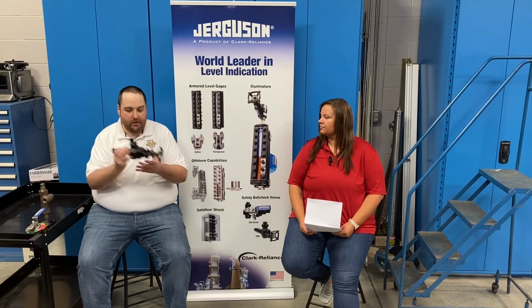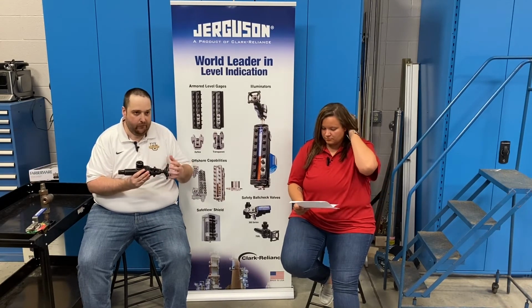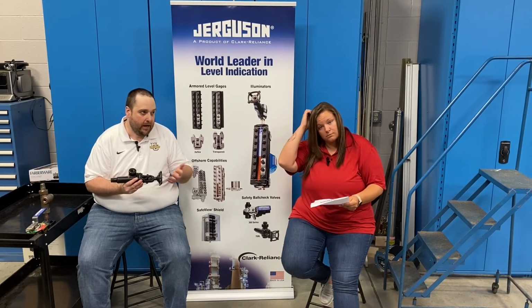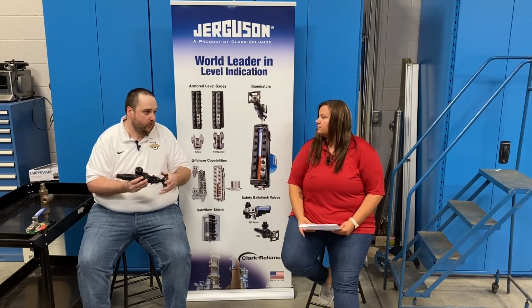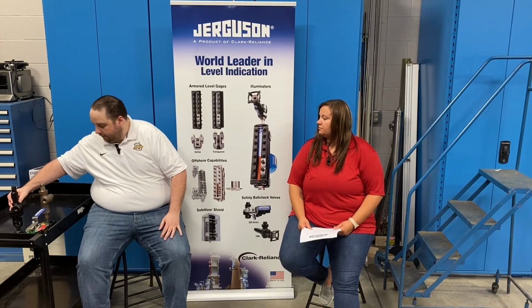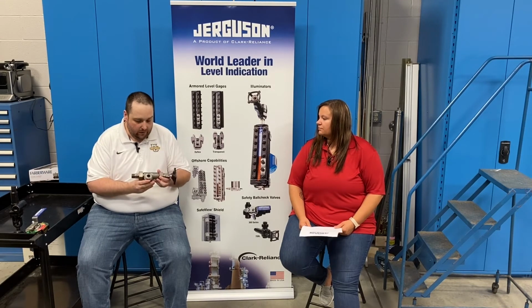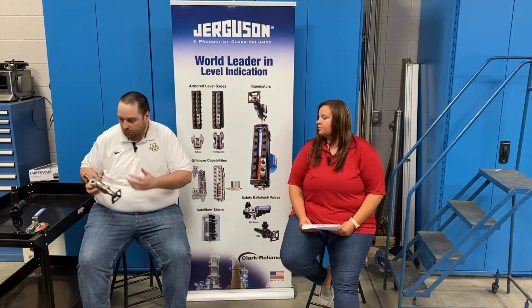On our 70L series valve, the 70L series valve is low emissions as a standard, whether or not you have standard packing or plain close and quick close. But quick close is an option for this one. And then on our 60L series valve, which replaces our old 60 series, the 60 LE series is always low emission, but it does not have quick closing threads. So the answer to that question kind of depends on the valve you're looking at.